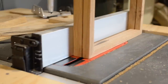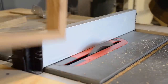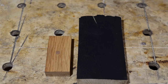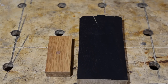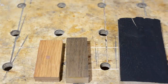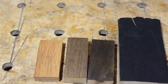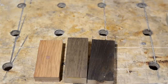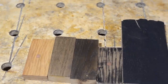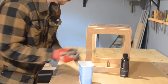When I initially quoted for this, I suggested staining it black with India ink, which I thought would look great with the contrast of the copper. So I showed the client some options — the first is Danish oil, then there's the India ink one. They thought the ink was a bit dark, so this one is with one coat of ebony stain and that is with two coats. I also took a bit with the India ink and sanded it down so only the bits in the grain remained — they really liked this option, so that's what we're going for.